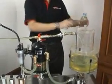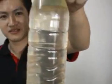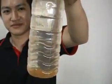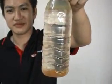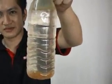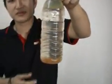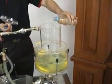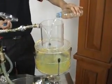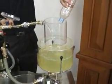Show the water first. Here we have water, which is in many instances a contaminant in diesel fuel tanks, that will now be run through the test system to test the effectiveness of the SFD Purifier filter. So if you could go ahead now, we're putting it into the chamber. This replicates a fuel tank within a truck or bus or other type of vehicle.